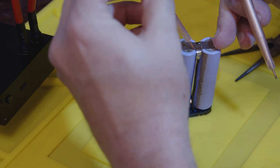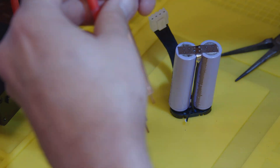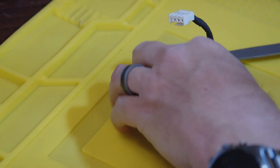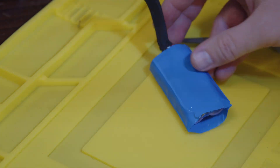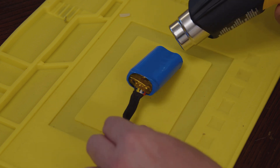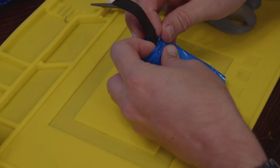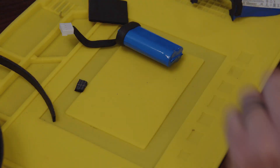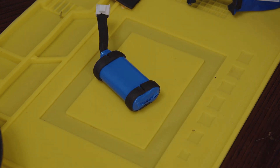Here is where I made a mistake — I should have turned the spot welder down to power level 2 for welding two strips together. Luckily that little piece of hot metal did not compromise the battery sheath. I'm going to use a little heat tape to make sure the temp probes actually stay touching the battery surfaces this time. I'm also cutting a section of heat wrap to size. Then it's time to wrap this in more heat tape and put the shrink wrap on. With this kind of thin heat shrink, apply medium heat and keep the gun moving — and oops, let's put a second layer on. The foam rings JBL put around each battery pack are just pipe insulation tape, which I happen to have a roll of. And here we are — a rebuilt battery pack with upgraded capacity.